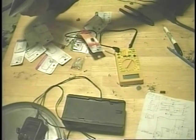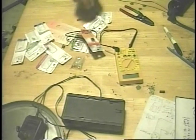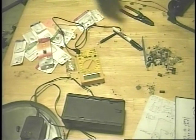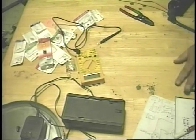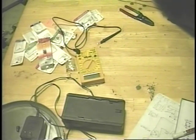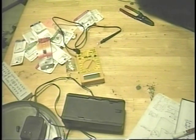Now, as I remembered, and which I have proven, you change the frequency that it turns on and off by the capacitor and the resistors. I knew that, but I didn't know which one did what and what happened there. And that's what we're going to go through, so you'll know all about the 555 timer, because I am using it since it seems to be pretty good. You'll know how to use it, how to put it together, and what it's supposed to do. And we'll get right on with that.